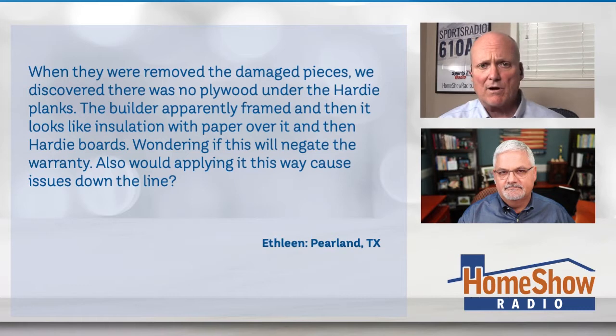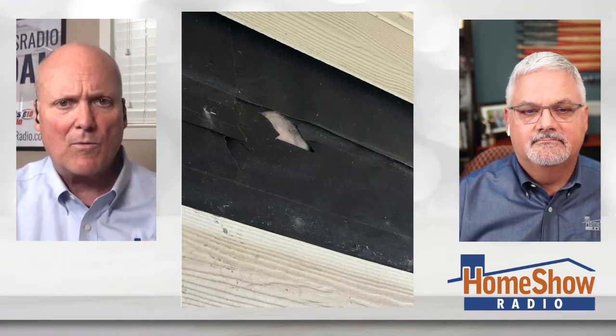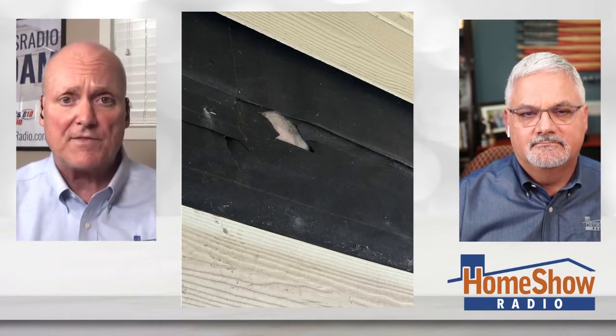No, I think if you read the Hardie warranty, it's going to be fine. They're not going to worry about that. One of the things, in fact, Hardie, if the spacing is 16 inches on center, Hardie warranties it. That's perfectly acceptable as an installation issue. Now, depending on the nails they use and stuff, if they fail, then Hardie won't have a warranty on the connectors. And I'm sure that's not a problem, so I'm not asking her to worry about that. But I think it's perfectly fine.